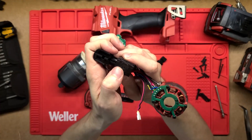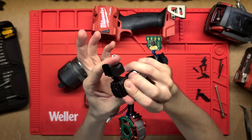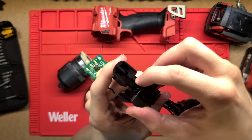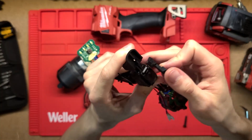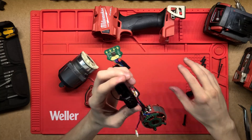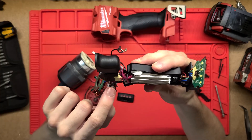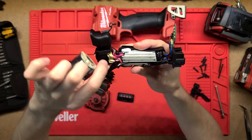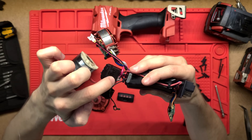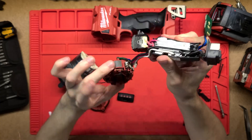Just have a look at the trigger — it's a fairly standard trigger. Up the top we've got three positions for clockwise, counterclockwise, and a lock position in the middle. Interestingly, the trigger doesn't have anything internally to lock it — the way it gets locked is through this little dimple here that sticks up. The trigger just moves smoothly on its own, but when you put this black bit in place it prevents the trigger from being pulled. The trigger itself acts as a switch passing the full battery load, but it also has a potentiometer with a wiper that passes a signal to the motherboard, which does the processing and sends power off to the motor through the MOSFET transistors.